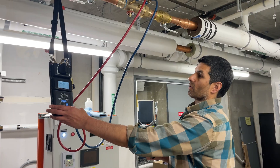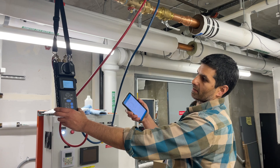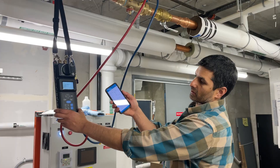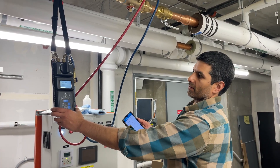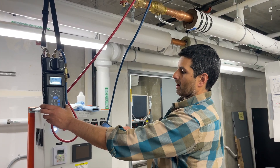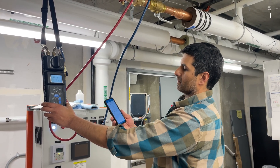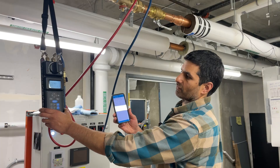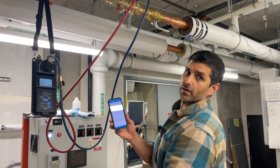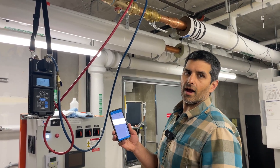At this point we've determined the flow through the valve based on the hydronic manometer's reading, using that reading and the app. We can see that from our last measurement the pressure has gone down and therefore the flow has gone down. We can update our reading by changing the input pressure — let's call it 12.5 feet of head — and now the flow is reduced to 7.5 gpm. The flow through this pipe is variable, so as the dynamics of the system change, the flow changes.